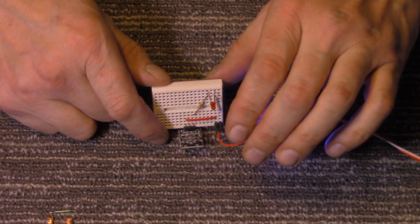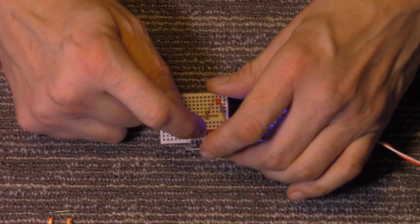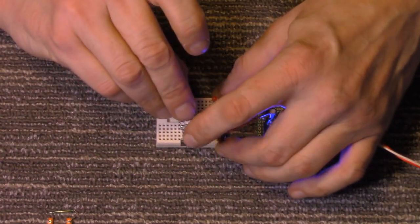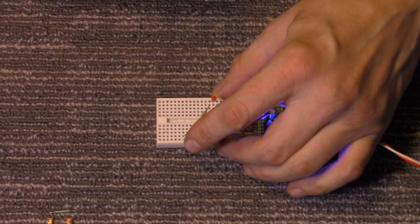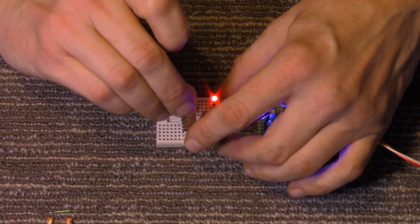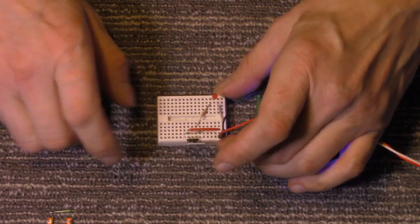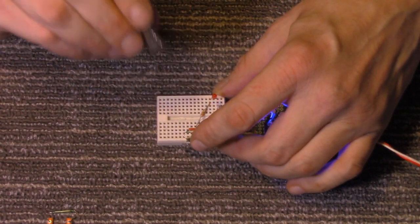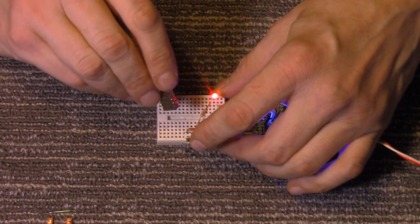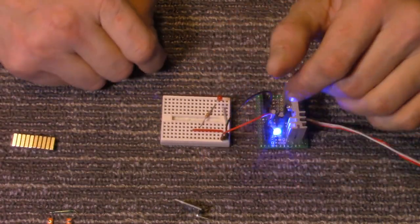I think this sensor, I don't know, when it came, it was all smushed down. I think mine might not be working very good. I actually ordered some of just these reed switches for further projects we'll be doing here on this channel, but I got one of the 30-some sensors in one kits to try out for doing these videos. Yeah, this particular sensor is not working very good. Like I said, it was smushed down. I think it's malfunctioning. It's kind of working. It looks like it likes to work better when the magnetic field's further away. But it does work. This particular one is just not functioning properly. After this video, I think I'll go ahead and just throw that one away.